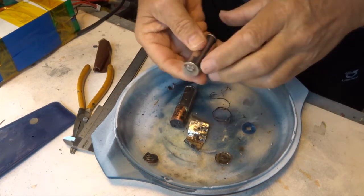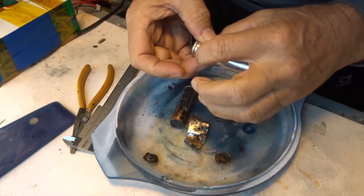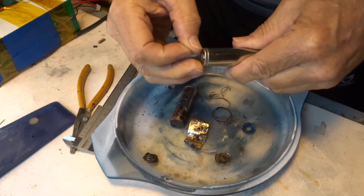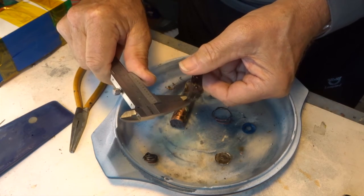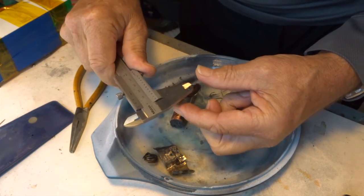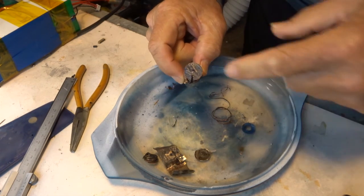I dismantled an LG lithium-ion battery to check the thickness of this metal. This is the negative part from here to there, and this is the positive part. These batteries are completely dead — zero volts — so I opened one, and this is 0.1mm only. The bottom part also 0.1mm only. So there is a reason to be careful; I punctured a battery by spot welding several times.